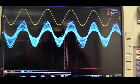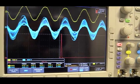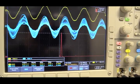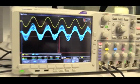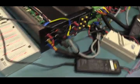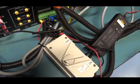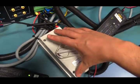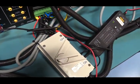This is what we call grid synchronization — it means the voltage generated by the DFIG is the same as the voltage from the grid side. Only under this condition can we close the switch between the DFIG and the grid. If I close this switch, there is no transient because the two voltages across the switch have the same magnitude and the same phase.